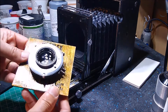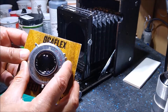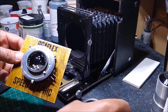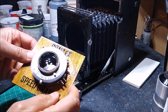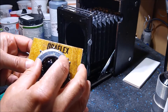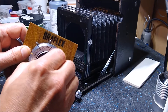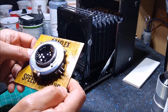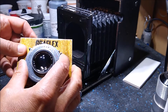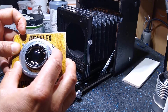I'd like you to look at the lens shutter assembly itself — it actually works very well, much to my surprise. After I pried off the filter adapter and cleaned off all the RTV, everything seems to work almost like brand new. The front element and the back element simply screw off, so you can take those off and clean them with a little Windex or something, and it's nice, bright, and clear.